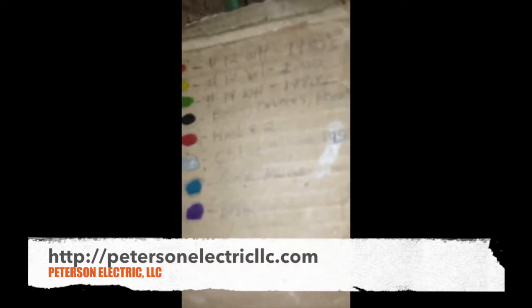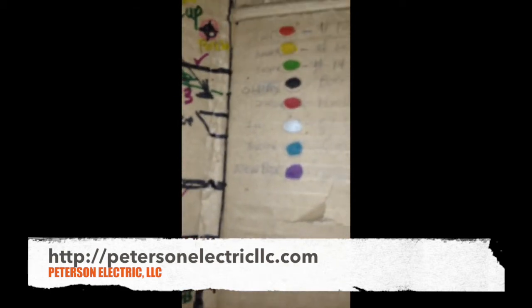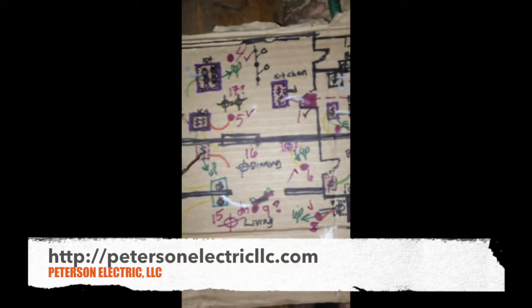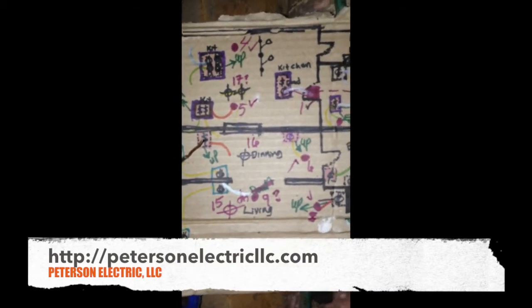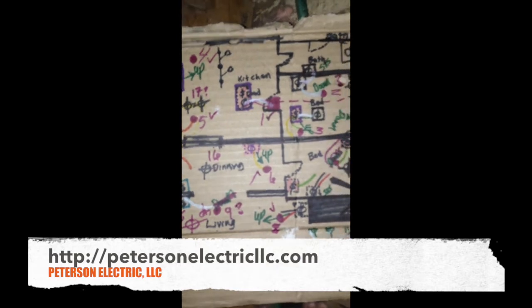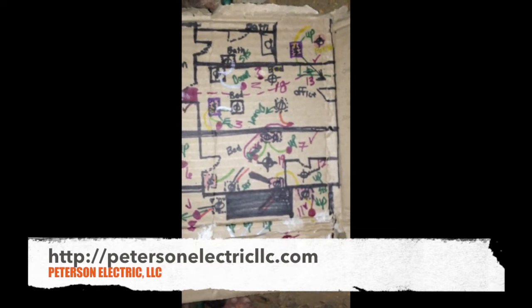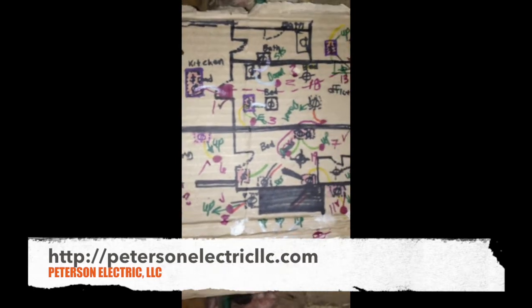When I show you something, I had to trace this out. This is representing how I figured out 12 gauge, my boxes, knob and tube. I color coded everything, came to my schematic, and I traced through and got 35 openings on one circuit — circuit 26. I went through to the top and labeled 1 through 19 drill holes from the top between lights, power plugs, switch looping down, or just power outlets or switch loop switches.